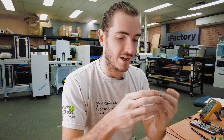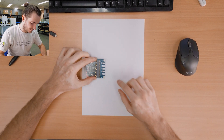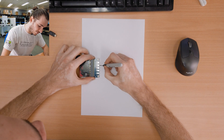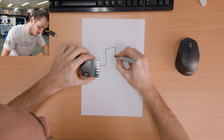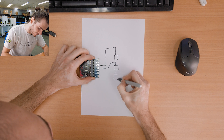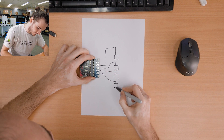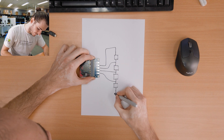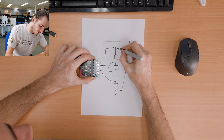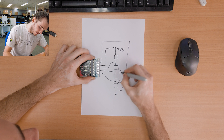What I would like is some kind of fixture, some kind of jig that holds the micro:bit in place, where we can put the device under test in and slide a jig onto it that tests all conditions at once. Here we have our device under test being driven by the test micro:bit. If we pull three volts out we can go through a resistor ladder — pin two will pick up from one part of the ladder, then pin one, pin zero — and this will go to ground. So we've got 3V3 and ground, and we have three unique voltage levels: V0, V1, and V2.